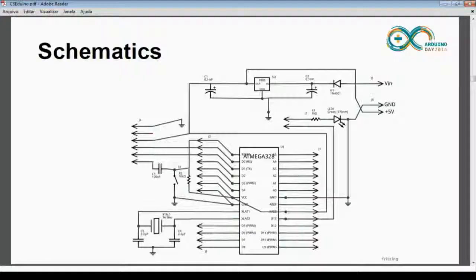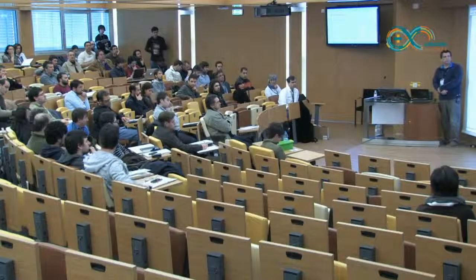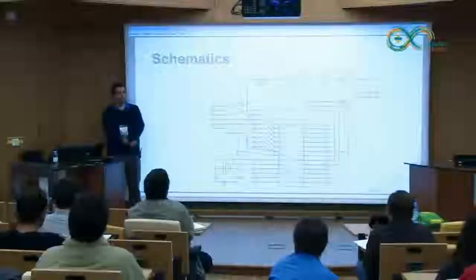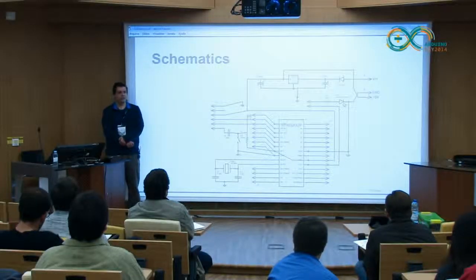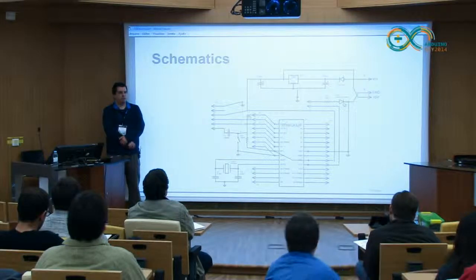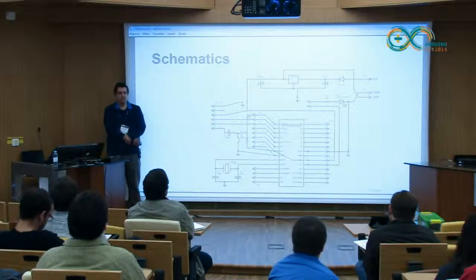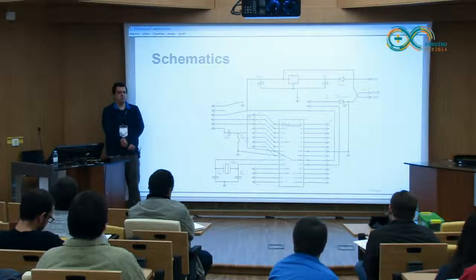This circuit is very good for a 9-volt battery. It works very well. As soon as you increase the voltage, it starts to eat up power. I've used the 7805. It's not a perfect regulator. It has that major issue that it consumes a lot of power. There are better voltage regulators, but typically they come in smaller sizes and are more expensive. And this is a hobbyist project, so let's keep it simple and very inexpensive.